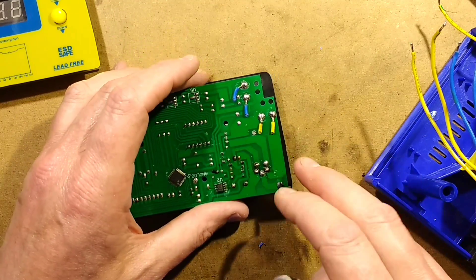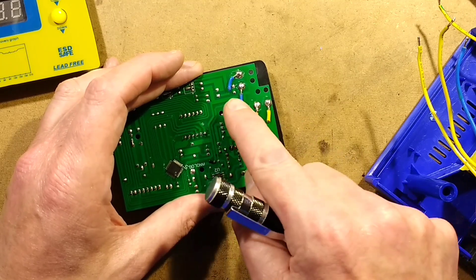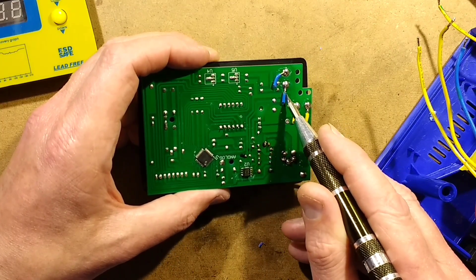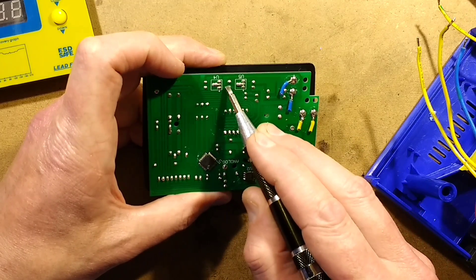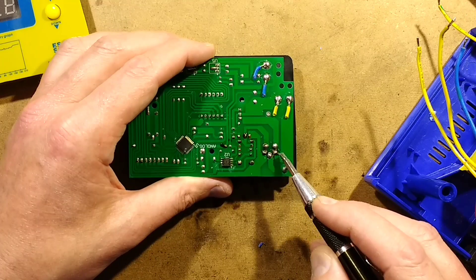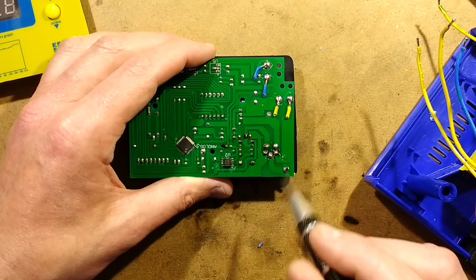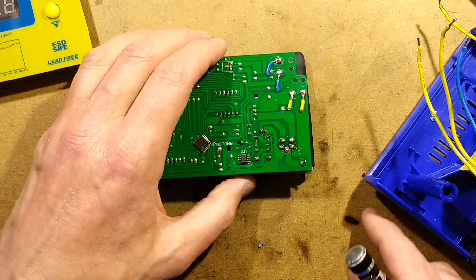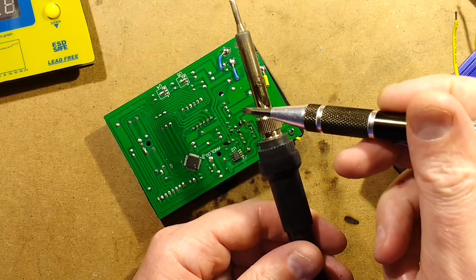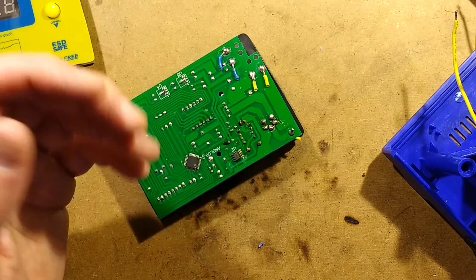If you do disconnect the wires, it's worth noting they have to go in the correct colour combination. It doesn't matter which way round they go as long as you've got the two yellow ones for the heating circuit and the two blue ones for the logic circuit. The logic circuit is the low voltage winding - one connection is used as the reference to ground, and the other goes through two diodes, two separate capacitors and voltage regulators. The heat element connection goes to one terminal of the heater via a triac, and there's a resistor and an opto-isolator so it can be controlled without any direct reference to the yellow connections. There's also an earth wire at the bottom to make sure the tip of the iron is effectively referenced to ground, protecting delicate electronics from any voltage leakage.